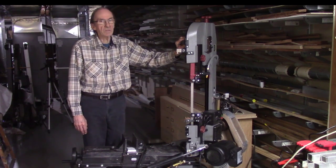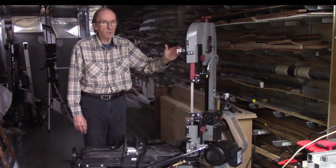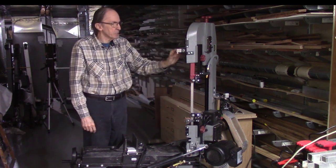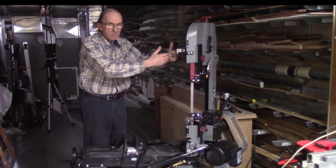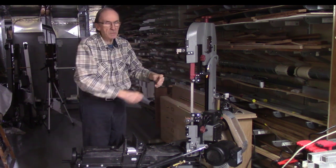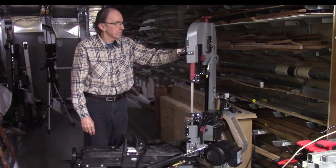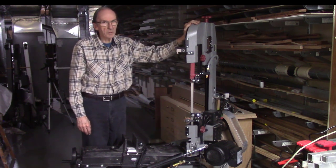This was quite a job getting this aligned. Normally when I'm setting this up on a normal vertical bandsaw, everything's at 90 degrees. The Accu-Path has several degrees of motion for setup and alignment. You can move it in and out, you can twist it up and down, and you can rotate the laser beam to get it aligned. Now on top of that, with the horizontal bandsaw, I have this cased at a 45 degree angle, which makes it even more difficult to install.